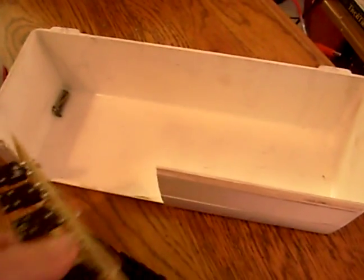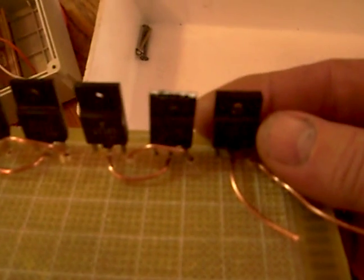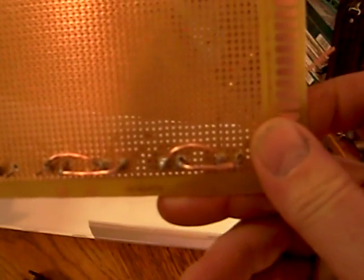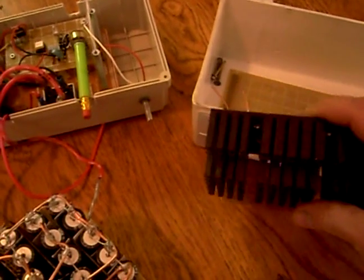Here are five deflection-type transistors out of televisions, starting with 14-gauge wire. I just stitched that wire through there like you were darning something — that's 14-gauge house wire. It comes out on the back; you can see I stitched it through there. That's your collector and emitter, and then my trigger goes in there. I won't have to have a lot of fancy traces yet — that's the best I can do right now. Here's where it fits in, and this is the heat sink that goes on there too on the outside.